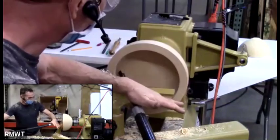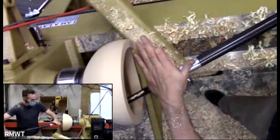So the finesse of this tool isn't ultra high and it's just side grain, but we still want to get a good finish across the side grain there. So we'll go for one more cut on that. So this time again, now the bowl might've already warped because it's a wet piece. So you can hear it's already warped a little bit. So you don't want to follow that bounce. So I'm going to glide down and cut myself a new surface without the bouncing noise.